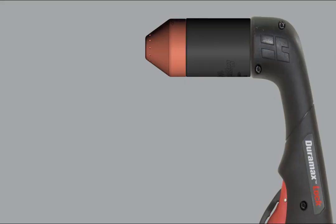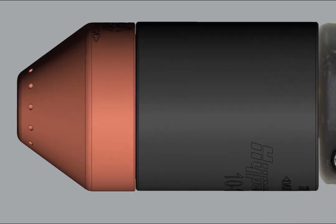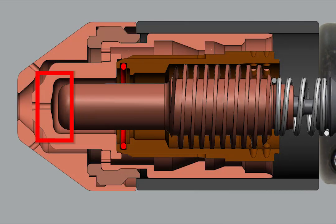There are two types of 0-30 errors. The 0-30-0 is an indication of a torch-stuck open fault, where the nozzle and electrode are not touching after the trigger is pulled.